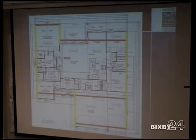Four frame garage, is that an option? Because with 4 frame garage, for an 8-foot plate height, you need 24 inches. You only had 18, so that doesn't work there. Again, sometimes that will work. You have 24 inches there, you still wouldn't work.